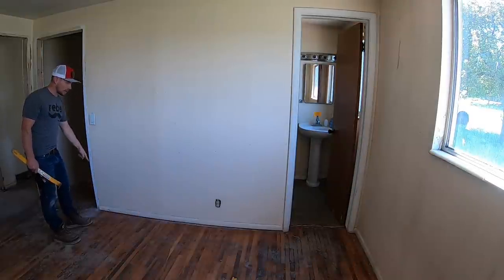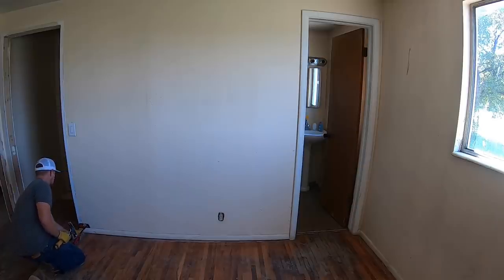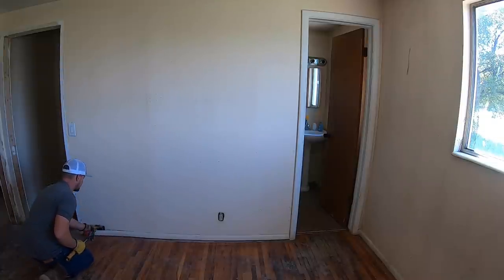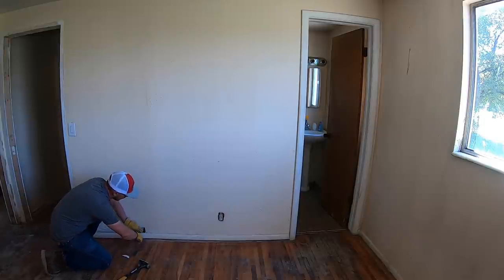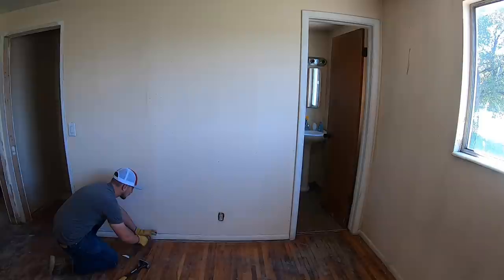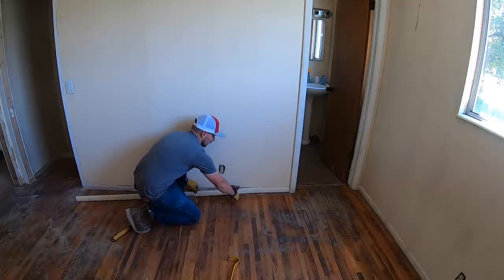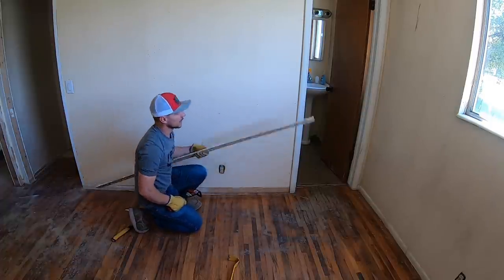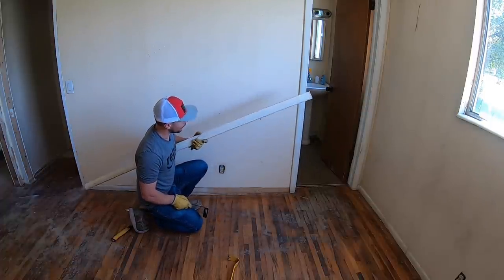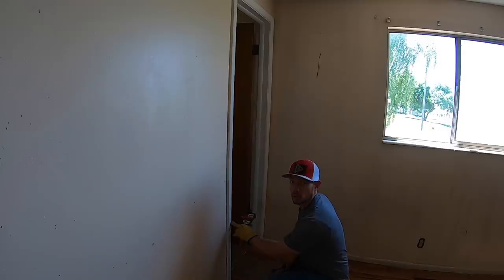Because this trim is already gone, I'm going to start from this section since it'll be the easiest, and just work my way around the room. Put your trim puller on top — and look, even though that was cut, it still broke out a little bit. That's a risky take but we can still fix it. If you're going to be putting this trim back, I really recommend you delicately pry along it and pull out and it should pop. Then set it in a place where it won't get damaged, because this is very fragile material and it breaks easily.